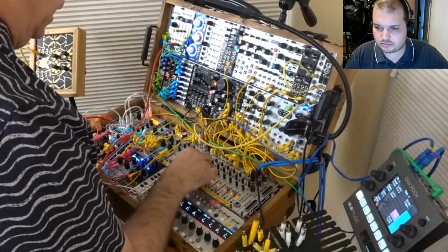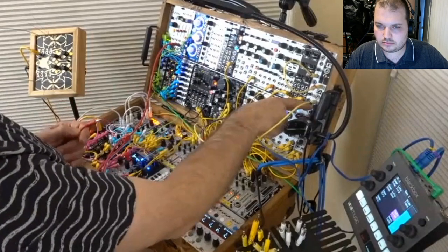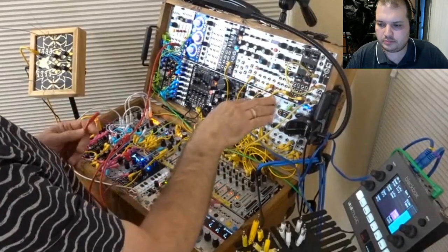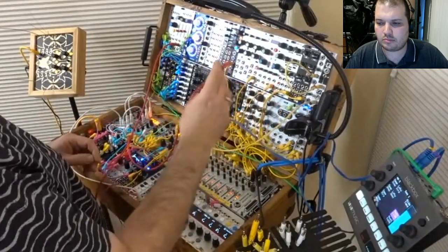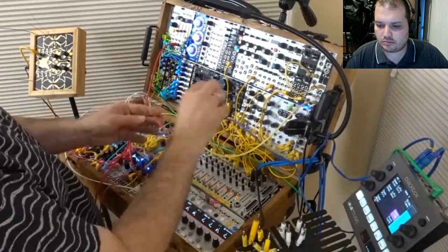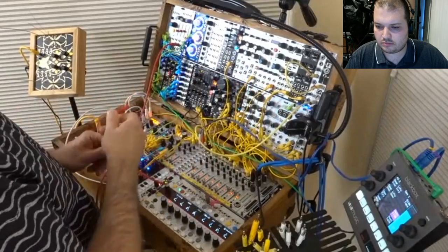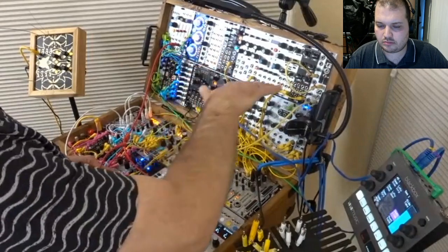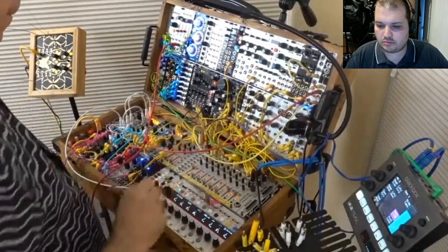Yeah, there it is. It does have some leakage. You can't hear it through Skype because Skype has a noise gate on it. But even when I bring it up, there's the hiss of the noise going through this, which is one of the downsides of the LXD. But also, when I start feeding it a CV, you'll hear that it takes several hits until the Vactrol builds up energy and opens up. And actually, that can be a cool way to start out a piece. What I did in that previous piece was I patched the CV with a fader up and let the beats naturally build as the Vactrol got excited. So it's going to get that going.